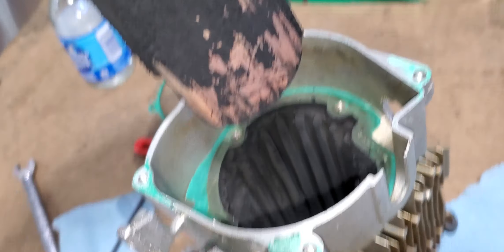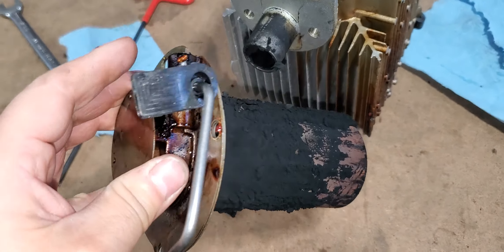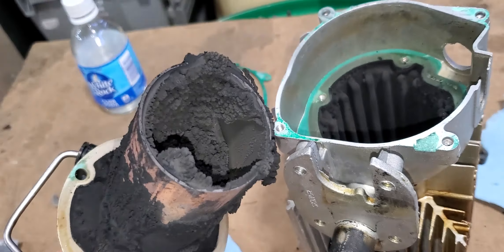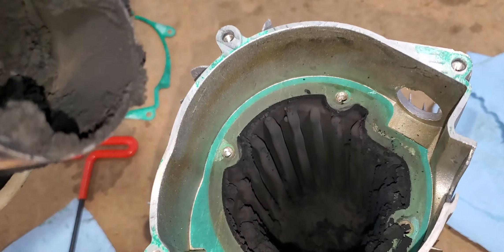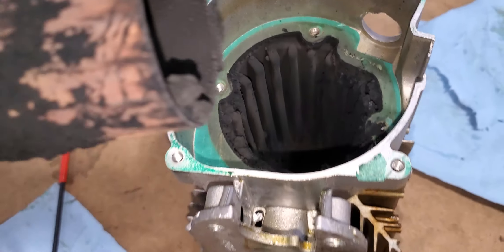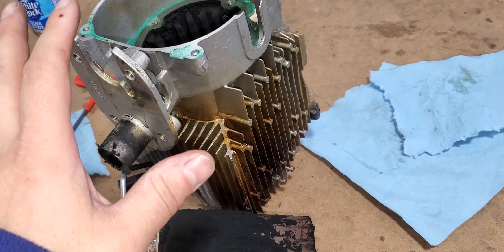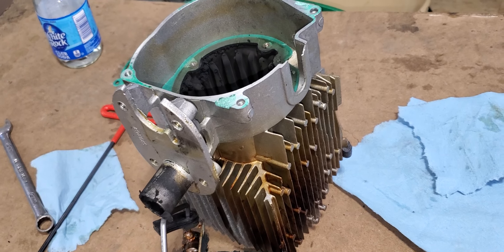That's pretty bad — I've never seen them this bad even on YouTube. It was completely clogged and still is, though I cleaned it a little. Veggie oil: no. Just diesel and kerosene. Heads up to anyone trying to burn anything else. Motor oil would probably be 10 times worse because it has so many deposits — copper, aluminum, steel — it'll cause complete chaos inside. No motor oil. Just diesel or kerosene. Thanks for watching.